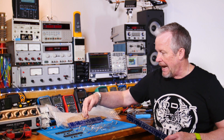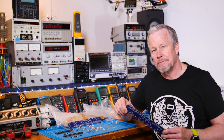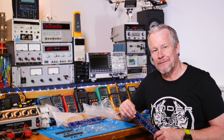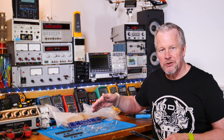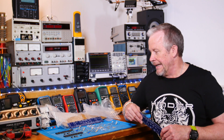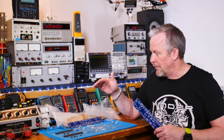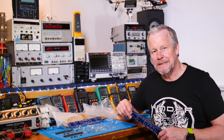I'm going to bring in some nice quality aluminum caps, especially for the signal path. The circuit was obviously laid out for a better cap, so I'll do that. Even the ceramic caps wherever the signal goes through, I'm going to replace those with poly caps. You might argue you can't really hear the difference, but there are arguments showing there is more noise — I think it's called shot noise — through metal oxide or carbon resistors versus metal film, and similarly for capacitors. It's frequency-independent noise across the spectrum.